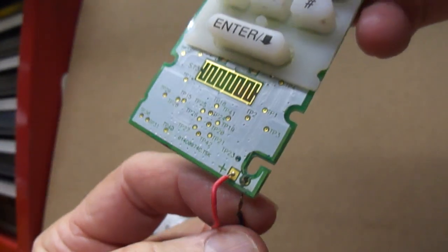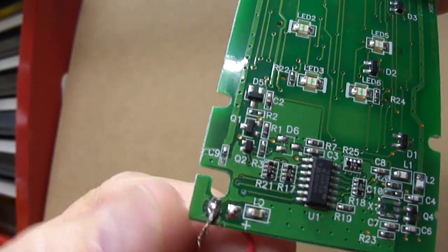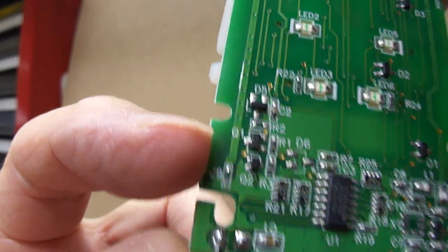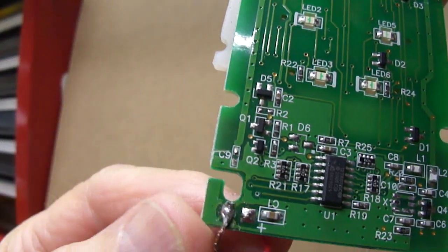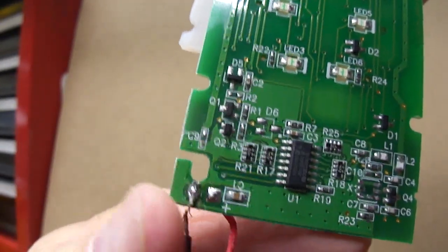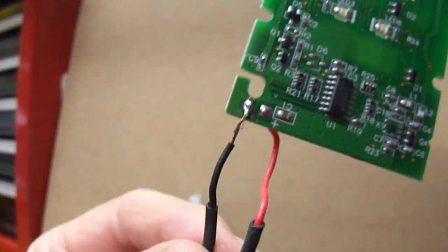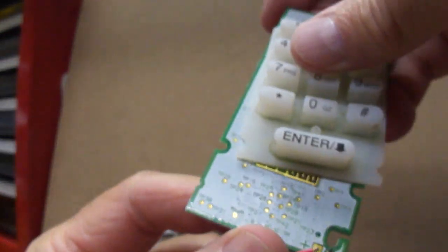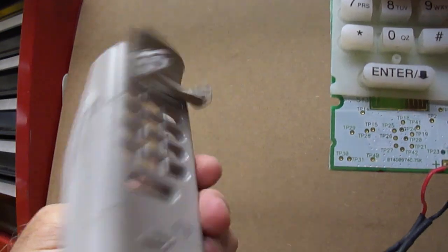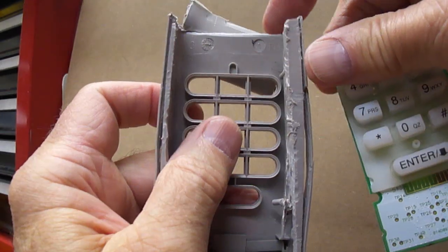So what I ended up doing was, the wire's loose, I just turned around and soldered it on the back side because I could reach that point. The problem with doing that is it's a very awkward place for a standard soldering iron, and it caused the capacitor in here to melt. These things are just mounted on the board by solder, and it just fell off, and I can't do anything with it. I don't have the micro soldering tools that you need now. So this thing was dead, even though I actually succeeded in making the repair. The fact that I could not remove the back on this case prohibited me from making a repair properly, which means it became junk just for a minor malfunction, which of course seems typical for anything anymore.